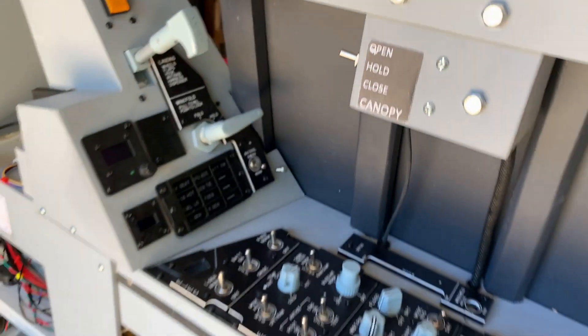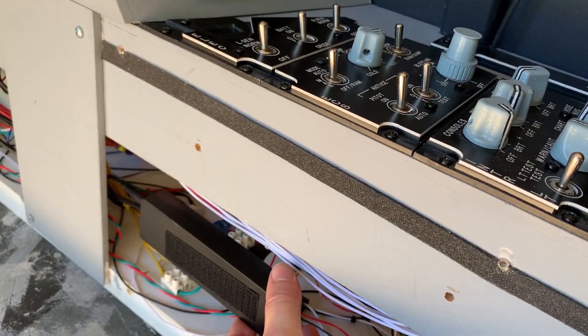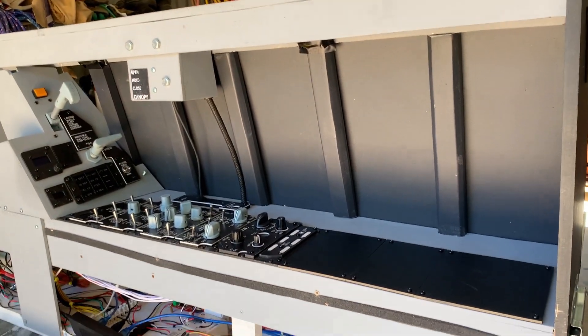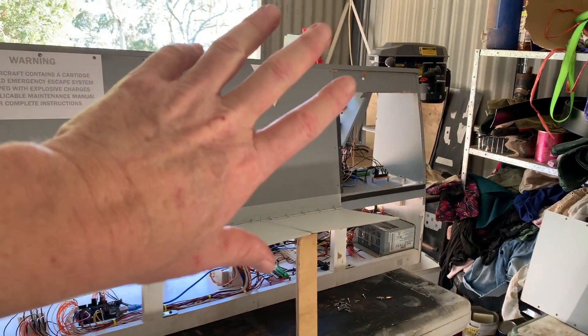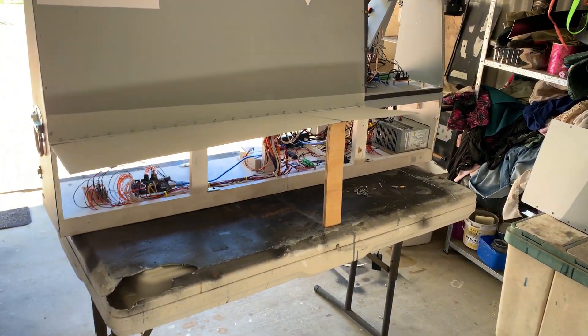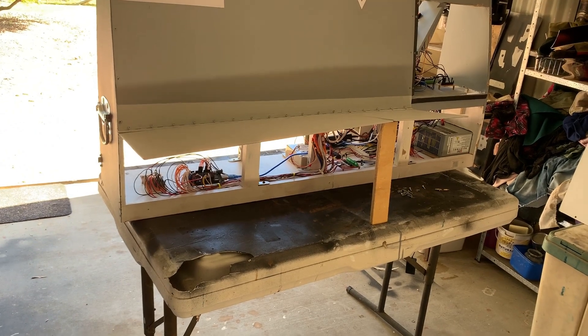That's really the top panel. There's a side panel here — that USB would normally sit up there with some velcro, and I hardly ever take this side panel off. How I access all the workings from the outside of the pit is I put some doors on the panel using piano hinges, and they've been a lifesaver. If I hadn't done that and could only access the other side, I'd be pulling the pit apart all the time. Having these doors has made maintenance and small upgrades really super easy.